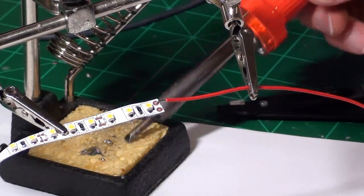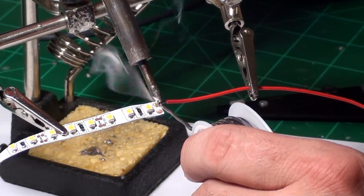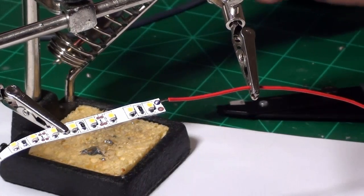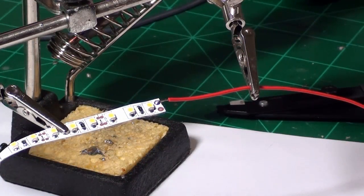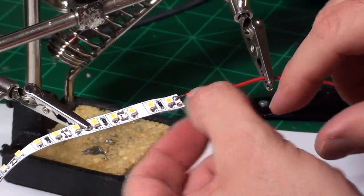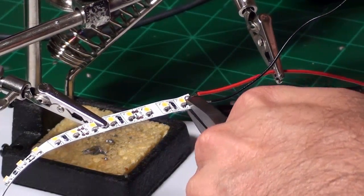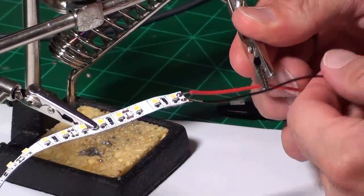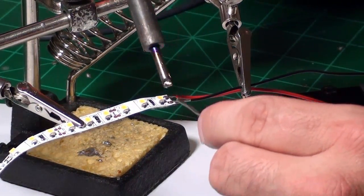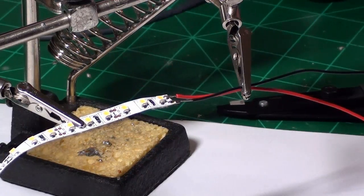I clean the tip off because it was building up some excess solder. Then I put some heat down on the joint, apply a little bit of solder — and there she is. Again, this is an incredibly quick process. If you've got the soldering iron on there for a long time, you're doing something wrong. Since that end is hot, I use pliers instead of my fingers. Heat first, solder second — and there she is, all soldered up.